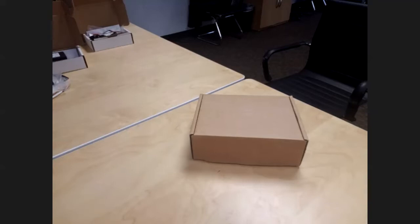So if you have the Rotax iS engine, you do need a different model of engine monitoring module. They're the same price. I think it gives up one of the thermocouple connectors that you wouldn't use on the Rotax anyway. So just be aware of that. And when we see you ordering a Rotax engine kit, if you don't have the right engine monitoring module, we help you fix that before you order it.